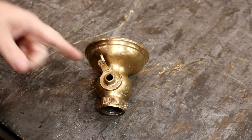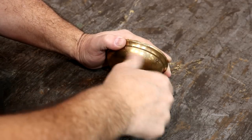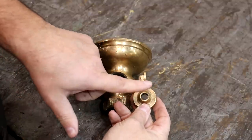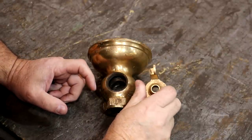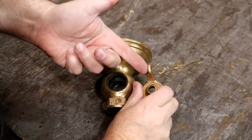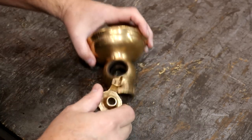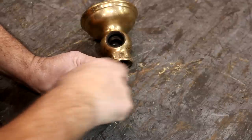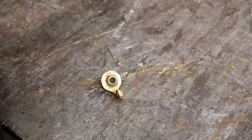This is the bowl off of a Crosby steam whistle. The part we're going to be working on is this piece that screws in the front of this — basically where the valve goes in through this hole right here. There's a little stem that sticks out, a spring that loads behind it to keep the whistle valve closed, and a lever that pivots on a fulcrum to push the valve stem in and open the valve, letting steam up through the whistle. The problem is there are two little ears that the lever goes between, and one of those ears has broken off. That's the job of the day.